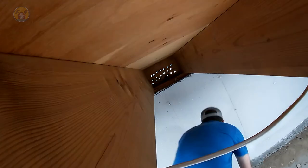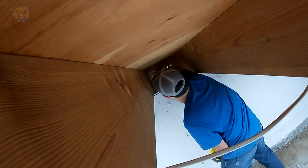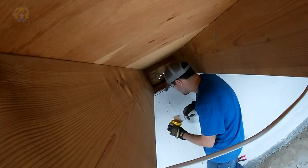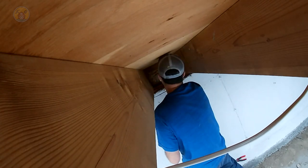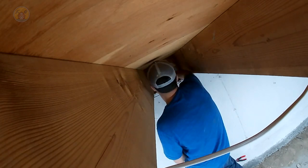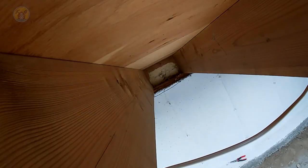This was an unconditioned crawlspace, so they had venting — but it wasn't enough venting to be properly unconditioned, so it was kind of the worst of both options. So I'm trying wood putty for the first time, just sealing in all the holes, trying to make it airtight. I think I used spray foam on the other side. Just sealing it off so no exterior air can actually get into the crawlspace — that's how we get it to become conditioned.